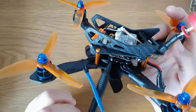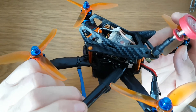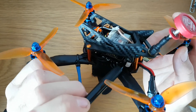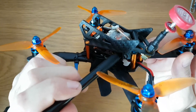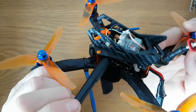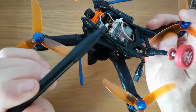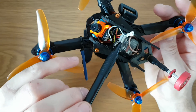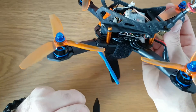On these particular micro boards there are no individual motor input pads, so you need to use the connectors which come with the ESC. Everything runs from the cable connector here to the cable connector on the side of the F4 flight controller, with wiring running from the RunCam Micro Swift directly to the board. I haven't bothered using the 5V output on this simply because I don't feel the need, and it makes for a cleaner build to run the wiring straight from the camera.